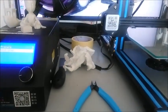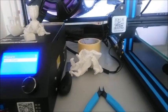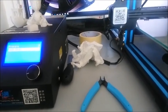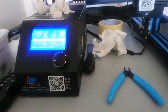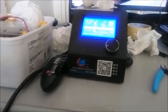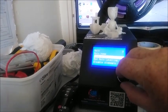Go to the center — it's a little bit tight. I think this bed isn't quite level but it's not too bad. It's getting under but it's a little tight, which obviously means the bed's a little bit concave or convex in the middle. So I'll go to Prepare again and go back to the beginning.